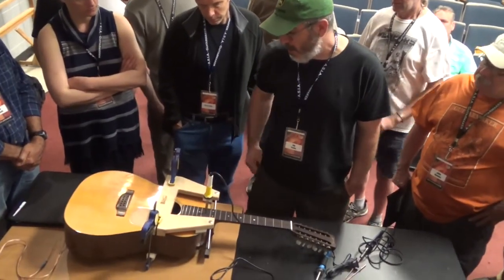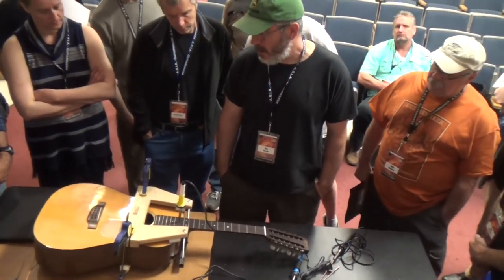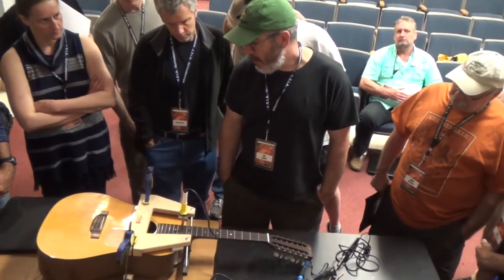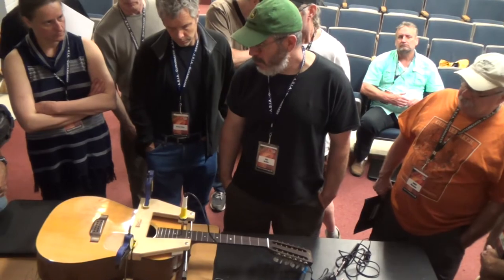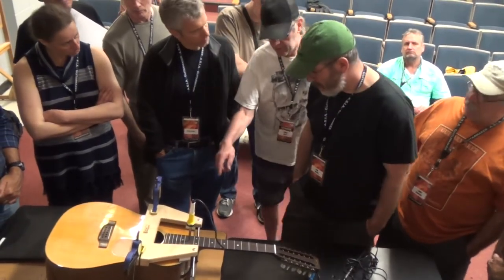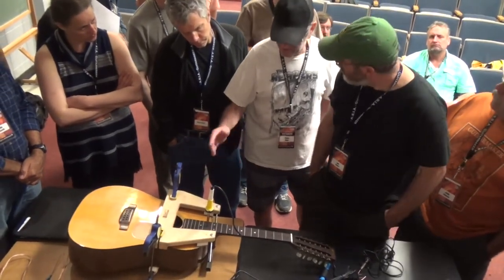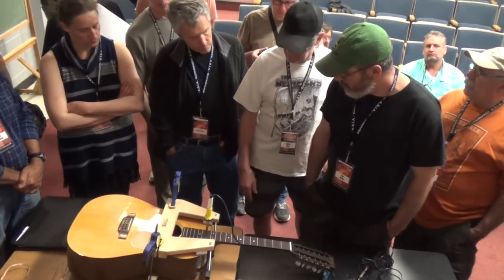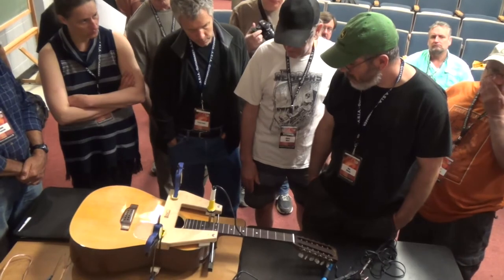If you get your knife into the run out and you have any run out issues, it can get really nasty, just like on a bridge plate removal or a bridge removal. What I do is cut a cardboard template and then put the foil over that, just to have a little bit of a cushion, because the foil will get hot too. So I worry about damage on the top.